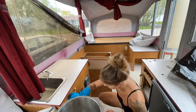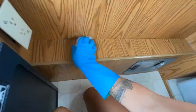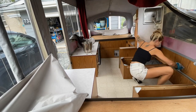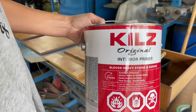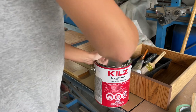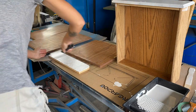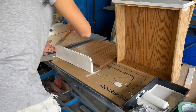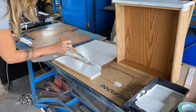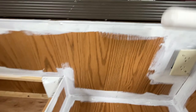When you start painting, first you want to put TSP on everything — it prepares the surface, removes any grease, dust particles, and dirt, making the primer and paint go on really nicely. The primer I recommend is Kilz. You do two coats: the first coat goes on quite thick. Definitely take your time — if something's darker and needs three coats, do it, because when you take your time with priming the paint goes on so much better.